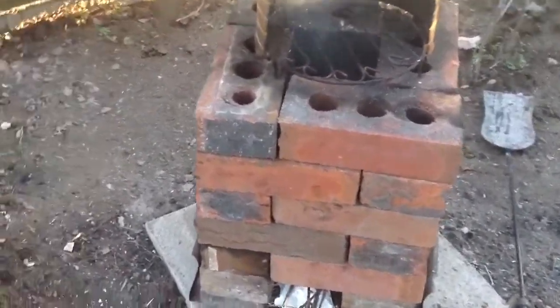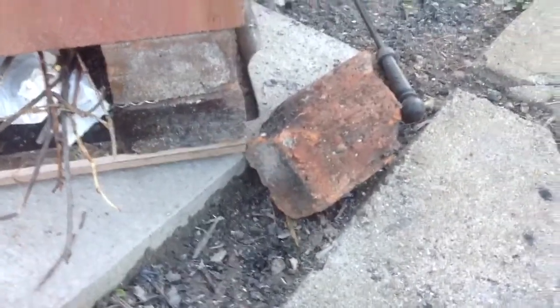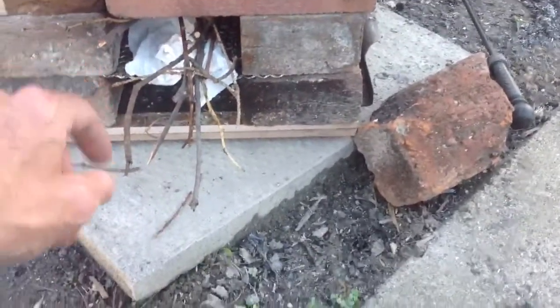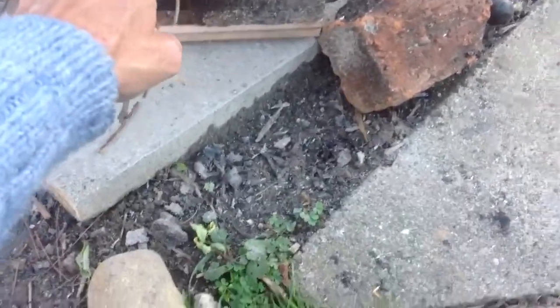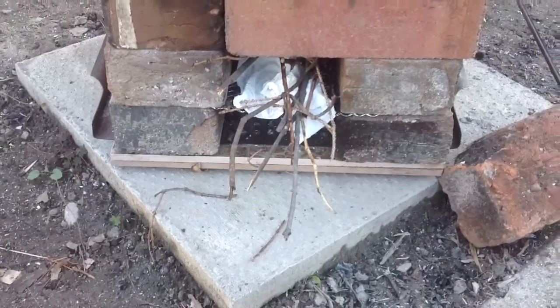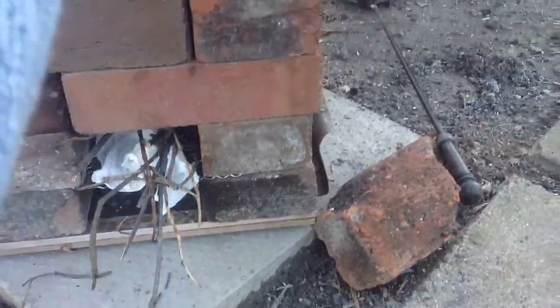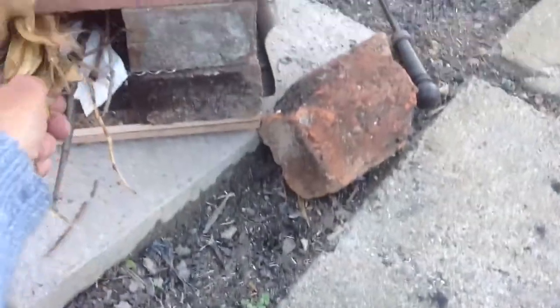Basically, this is the air chamber. Some people who build rocket stoves don't have that — they have a brick going across here. But we found it a bit more efficient to have your wood up here and your air intake here so they're not competing with each other. The whole beauty of this is the air: it comes in here and draws right up, and when it takes off it sounds like a rocket taking off. It's a pretty cool sound.